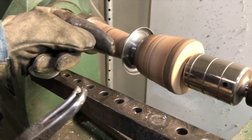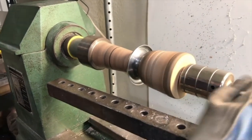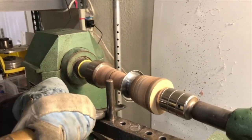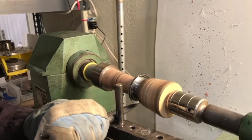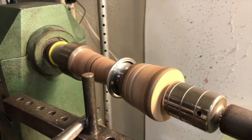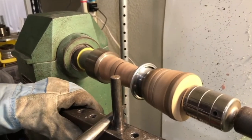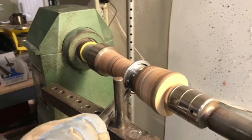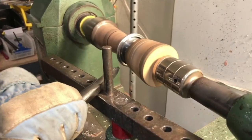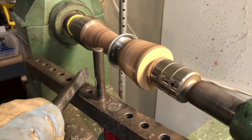That starts it, and the little crease the pliers put in gives rigidity to the piece to support it while you work the outside edges. Then I like to go back in with a basic spoon tool to bring that lip in. There are all different kinds of forms depending on what the piece is for, and you want to make sure it's tucking all the way in so people handling the pieces won't catch the edge of the metal. As you're tucking it in, make sure your tool doesn't contact the body of your spinning — it can gouge and leave a mark.